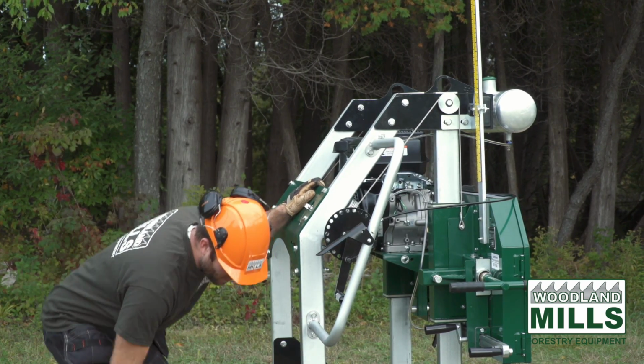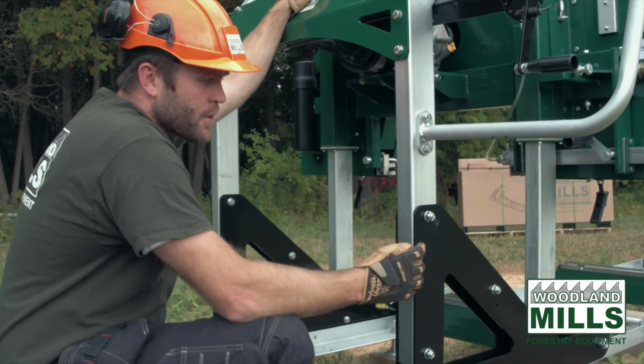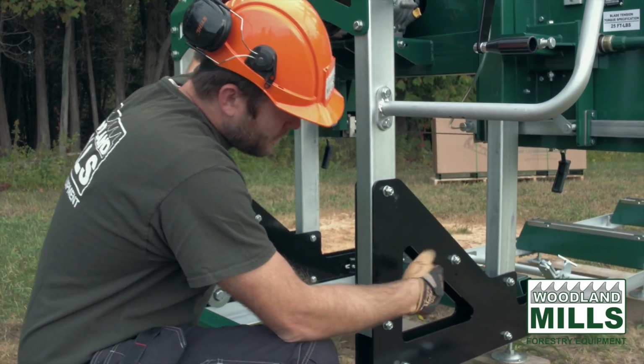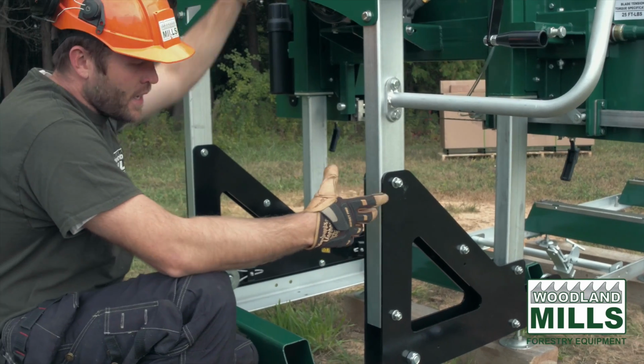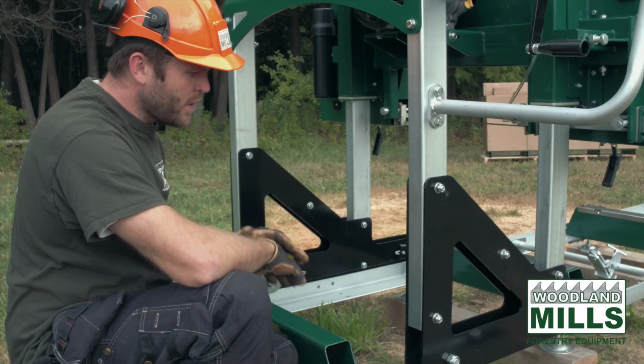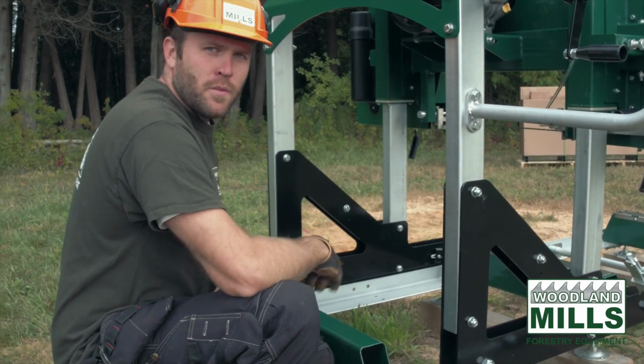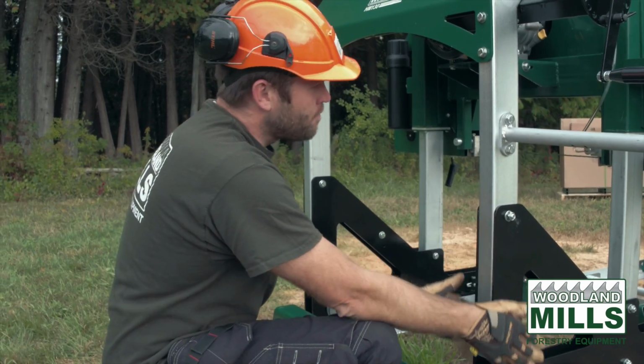As we come down here to the bottom, we use a sandwich plate design. And this gives us accuracy because this is all laser cut plate. It also gives us rigidity because we build a box. And it allows us to mount our carriage wheels, our sweepers, and it allows us to position all the parts where they need to be before we torque them down.